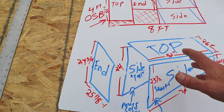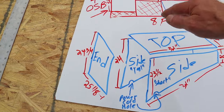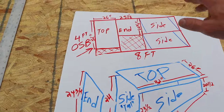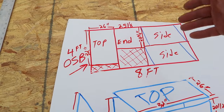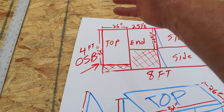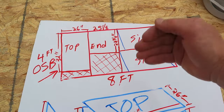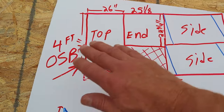To start this build I need to break down this OSB plywood. Here's the game plan for this generator sound shed — it has four main components: an end, a top, and two sides. One end is going to be open to let all the noise out. I'm going to cut the OSB into three main sections: one end does the top, the middle does the end, and the biggest section does both sides. Here are the rough measurements I'm going to use.